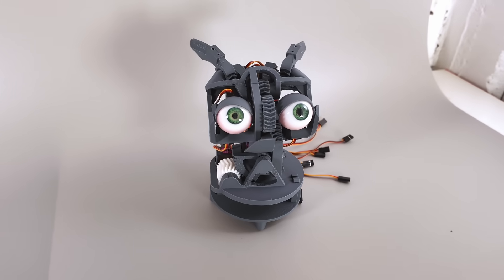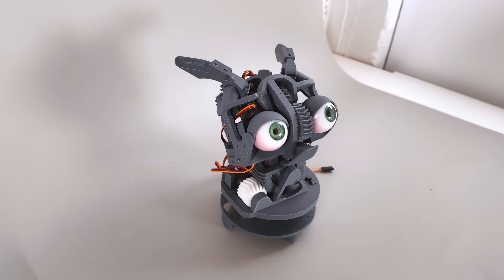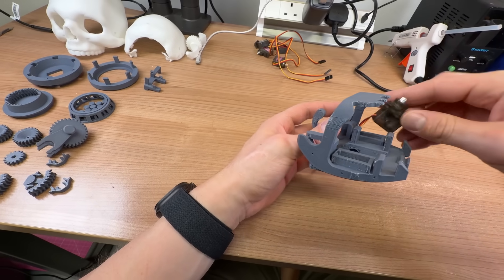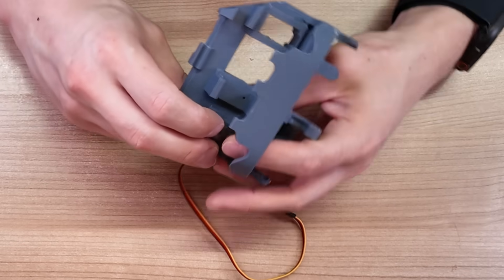Next it was time to make the mechanical design. The design is actually heavily based on my recent project Coglet, but in order to condense everything down even more I needed to move all the electronics up into the head. I'm not going to go into huge detail about the mechanical design since I've covered most of the design features in previous videos, but I will highlight a cool detail: in my effort to make my projects more accessible, I designed this one so that most of the servos snap into place, and the few parts that do need screws can use the leftover ones that came with the servos — so you don't need to buy any extra. These little packets have everything you need.